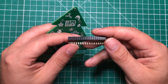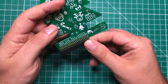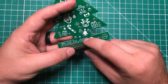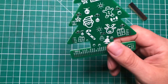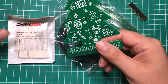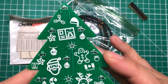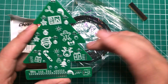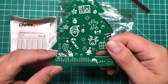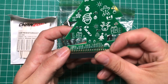This thing uses a little 40-pin header that is right angle. It goes on here and allows you to put this on top of the Raspberry Pi and leave some room for this thing to sit behind the network port. Then we're going to solder some 1206 LEDs and we've got some resistors. These pads are fairly generous so you can use 1206, ones a little smaller, or even a little bit bigger.